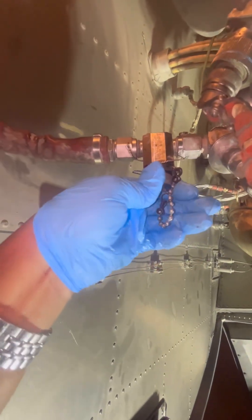The fuel comes through this line to the APU fuel control unit. In this procedure we are simply removing any air that might have collected in the APU fuel supply line through this APU fuel vent and drain valve.